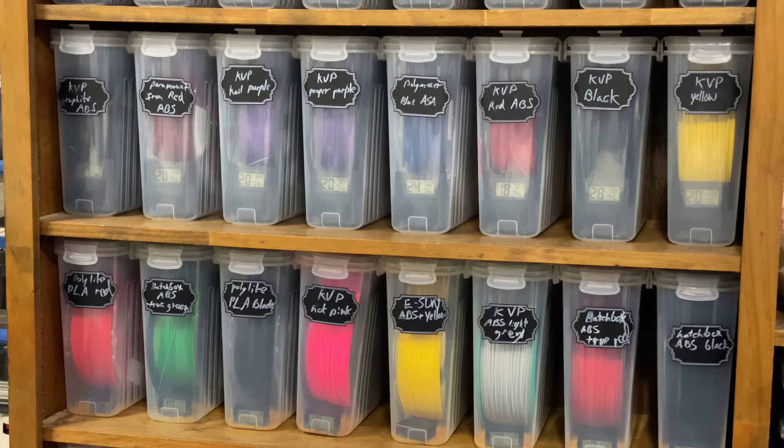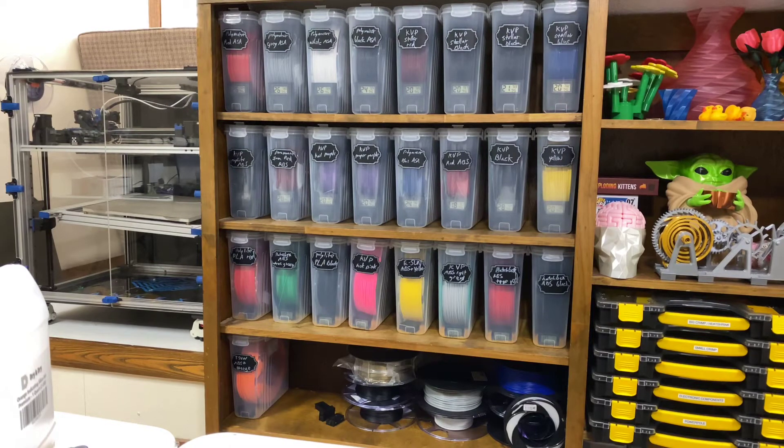So this is what I came up with. These are just my ready-made spools — I'll zoom out so you can see more of the shelf. These are what I have ready to go or partially used. I print a lot of repetitive colors like black and red and have huge amounts of refills in another closet, still in their original bags with desiccant. Once in a while I'll pull out the dehydrator and dehydrate the spools before putting them in these containers. But these containers will also draw some moisture out if you put the filament in them.